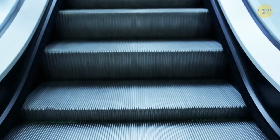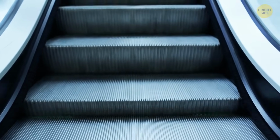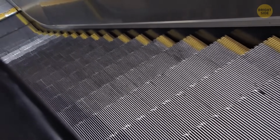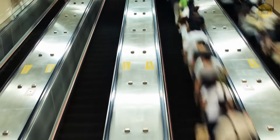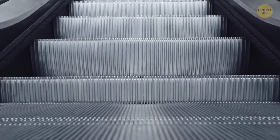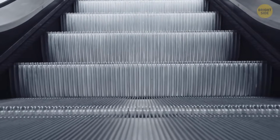Escalators have those fluffy black brushes for a similar reason that some have yellow lines on their steps, to try and deter people from getting too close to dangerous places. People don't always take notice, and sometimes clothing can drape close to the point where the step meets the edge or skirt. The brush is a little barrier to help prevent this from happening. They can also catch bits of fluff and prevent other small things from falling down into the gaps.